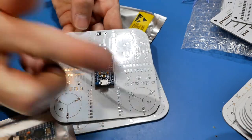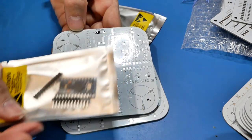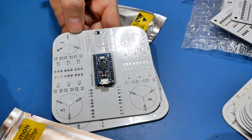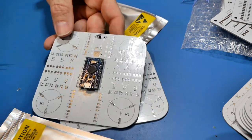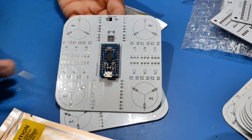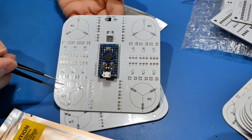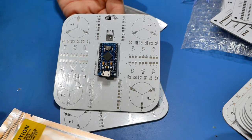If you're doing a lot of things like this, pick one of these modules that you like and just keep reusing it. Even though maybe a slightly different one might be marginally better, having the footprint already built is almost the main deal. I've got the footprint in KiCad - all I have to do is drop it in. I don't have to go make a new footprint for an ATmega or something.